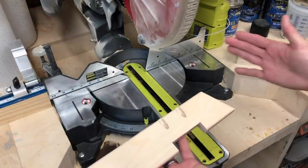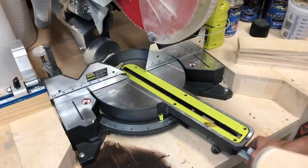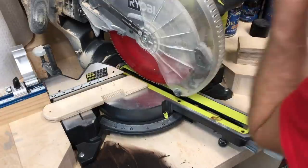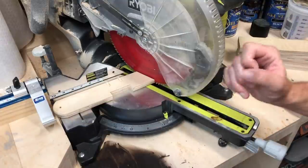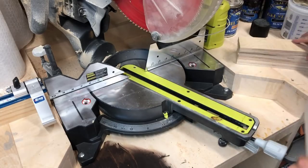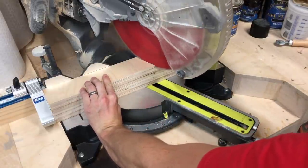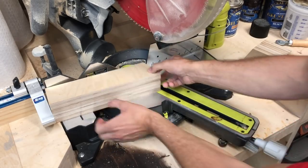We spoke about making your leg angle match a hard stop on your miter saw. What that means is your miter saw clicks at certain angles — like 15 or 22.5 degrees, which is what my leg is set at. That lets you reproduce the exact same angle every single time. What I do is lower my saw to that angle, lock it into place, slide my perfect leg up against it, and create a little stop with just a hair more length than needed because I like to round my legs. Then I can reproduce this length and angle over and over — unlock the saw, raise it up, throw two legs in and cut. Now I've got four legs cut to approximately the right length at the exact right angle.